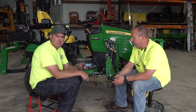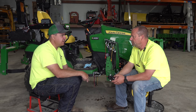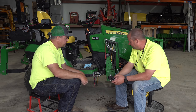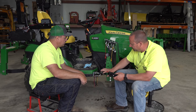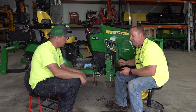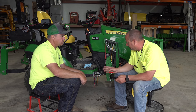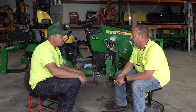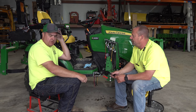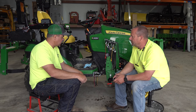Okay. This has removed a lot of frustration for me. It just becomes very frustrating when you can't get those to plug in. It seems like they ought to just go right in. And on some of the machines, the access to get to the couplers, to get good leverage to push them in, is almost impossible. So pressure or not, it's difficult as it is. When you add pressure to it, it's just even worse. So just do both sides. Run your joystick or your other electronic control and use the Waite tool on this side, and they should go right in.